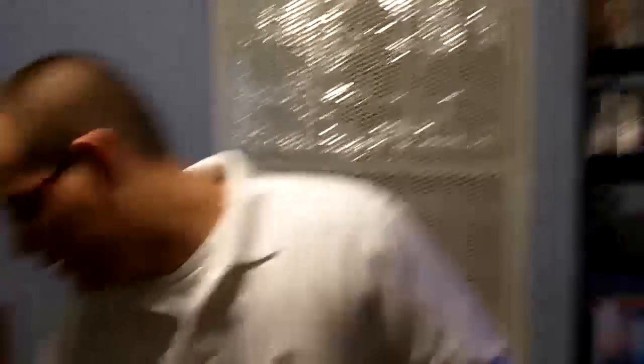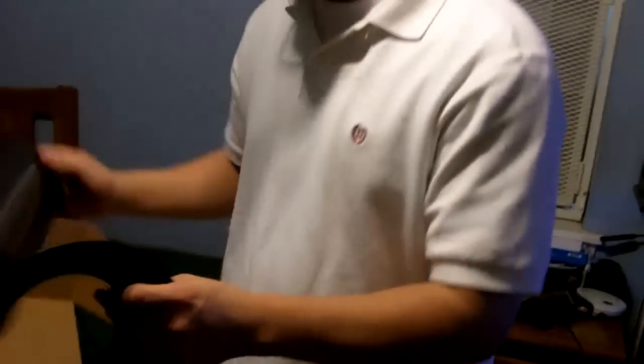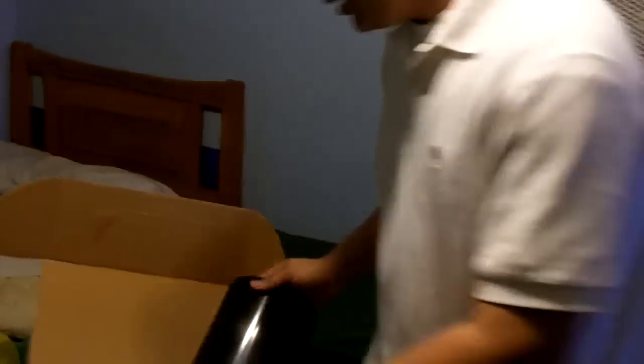This isn't that much, so you could have two holes if you really wanted to. I could, but I don't need it. So that's what an AeroPort is - it uses less air space inside your box, which is always good. That means you can have a smaller size box. Not only that, but if you have a lot of room, you can even put these on the outside of your box - connect it and have your whole tube sticking outside your box.